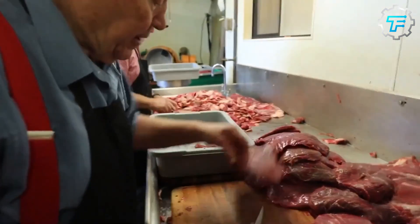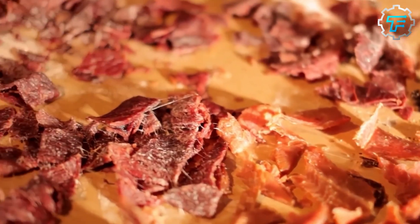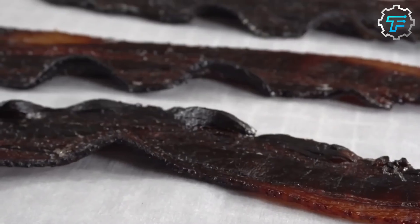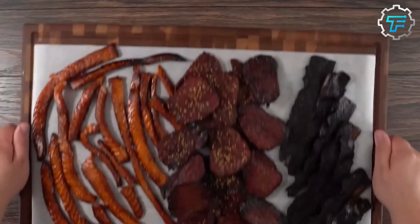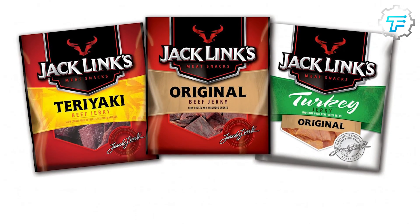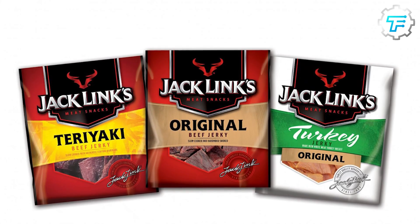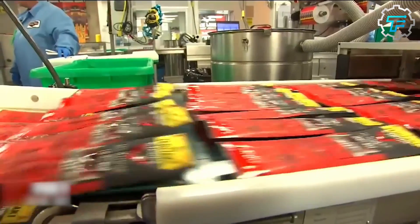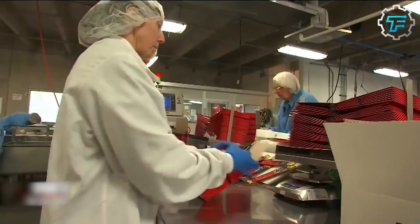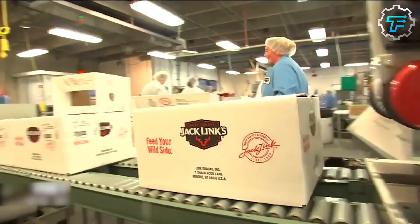After all these qualities have been checked, the approved strips are sent on to the next production stage: packaging. Before they are finally wrapped up and sealed in packs, the strips are conveyed to an automatic scale where the right amount per pack is measured. Meanwhile, the packaging machine prepares the pouches, which includes printing the expiration date, installing a zipper, and filling each bag with nitrogen to displace oxygen. Oxygen is eliminated because it is one of the biggest agents that initiates food spoilage. For extra protection, another machine drops a pack of oxygen absorbers into each bag, and with that they are ready to be packed with the pre-measured beef jerky.